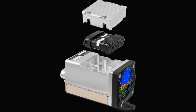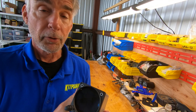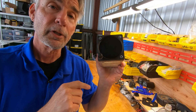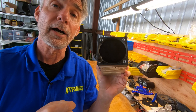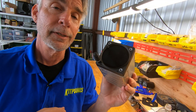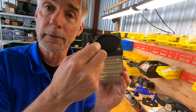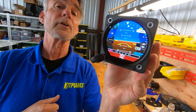Under here there's a backup battery. It's required for the attitude indicator but not required for the MFD. You'll also notice the knob set is in the lower left-hand corner. That's really designed for certified aircraft where there's probably a cutout — maybe an altimeter cutout — in that corner that they wanted to take advantage of. The whole idea behind the physical design from Garmin was to make it easy to install in general aviation aircraft. It's really not a big deal once you get used to reaching across the instrument to grab these knobs, and they're really nice and robust.